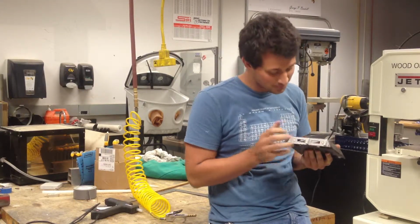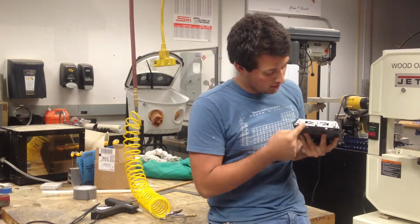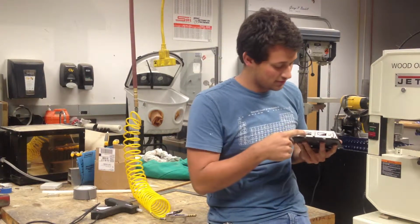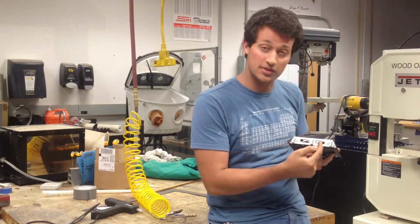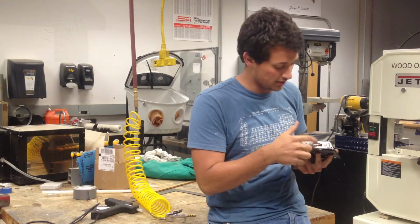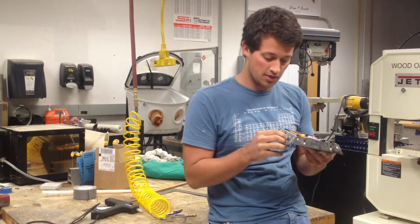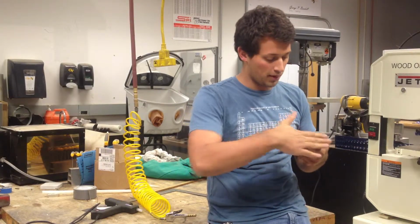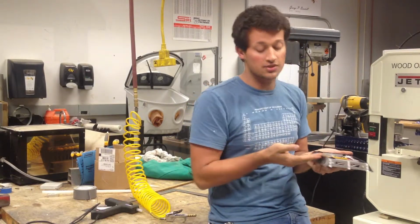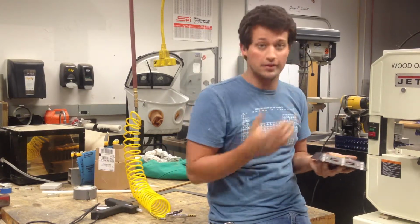I'm taking off the side armor here so I can show you all the weight saving techniques that I employed, a little bit in the wheels as well as in the actual aluminum frame structure, just a nice little truss there to cut some weight, as well as these notched pieces that are angled at 60 degrees for my armor, because it's a nice deflection angle for other robots coming in and their weapons.